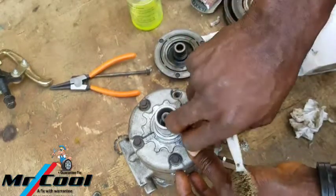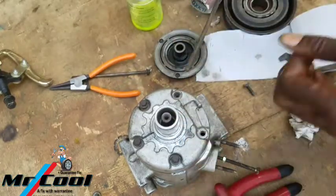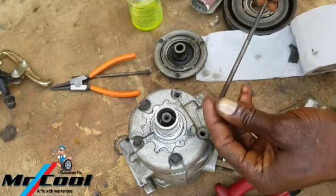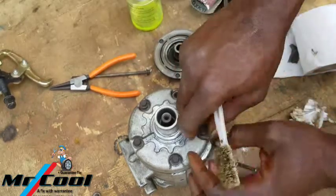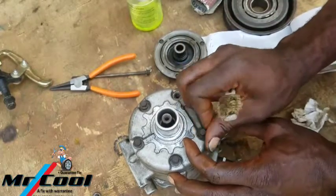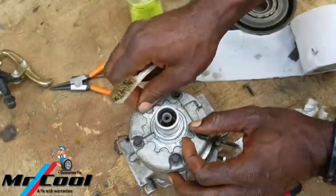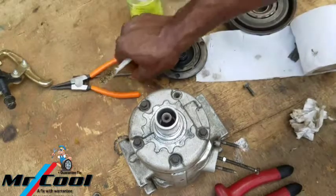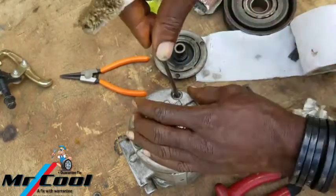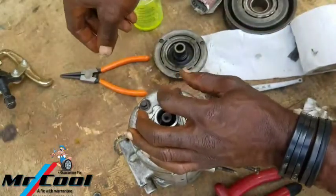Now we've made a mistake, and that's a mistake you shouldn't do. We put one without a spacer. If you put any of them without a spacer, it's gonna leak. Don't make a mistake. Check them while you're doing it. Let your mind be laser focused while you're here, because some sort of a distraction here is gonna be catastrophic. It's gonna make you waste your refrigerant. It's gonna draw you back into start tracing where the leak is coming from. 8mm.